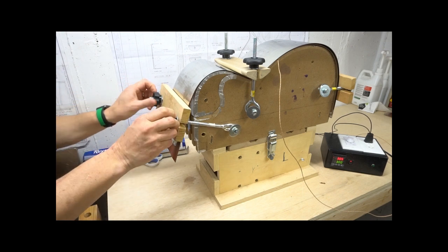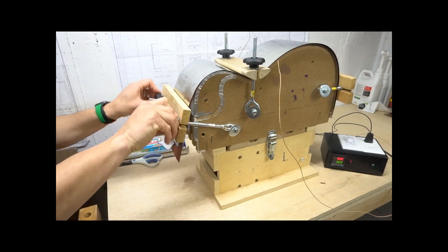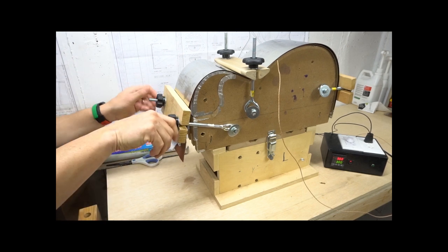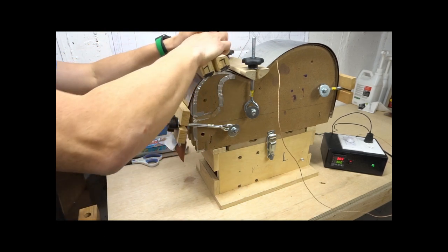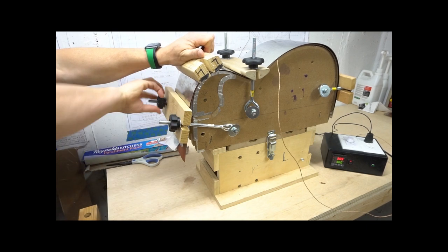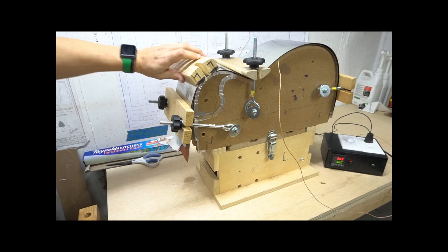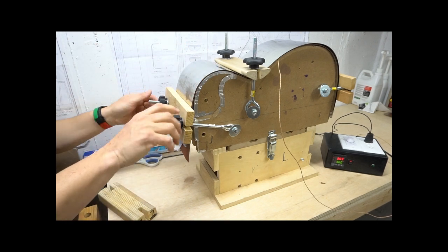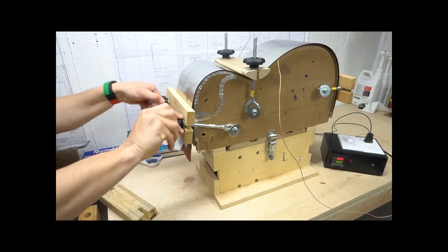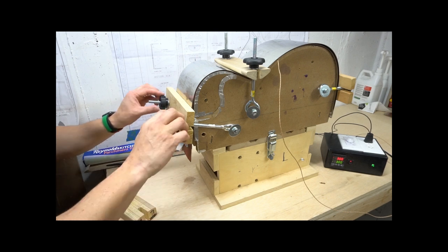Now the upper bout is just as prone to cracking and breaking and bending as the waist is, and in some cases maybe even a little bit more. Just kind of take my time a little bit, but not too slow, getting that bending. And if you hear that cracking, it's not anything to be worried about.